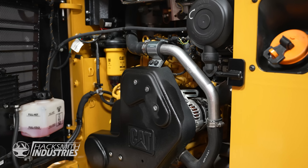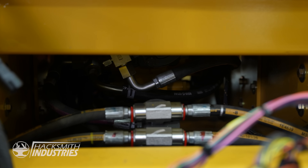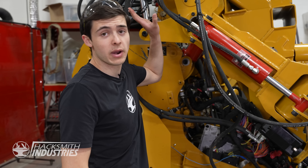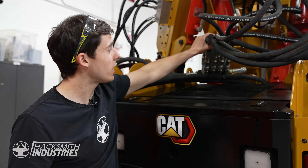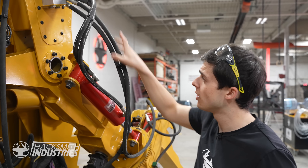Let me walk you through our current hydraulic system. Everything starts over here where we've got our diesel engine that produces the torque required to spin the pumps. Underneath the feet of the power loader we actually have two hydraulic pumps: the first one for driving the caterpillar and the second one as our auxiliary pump system for the arms. The hydraulic flow from the second pump comes up here where it's distributed by the caterpillar valve block — in our case it's used for powering the entire upper body. The valve block then delivers fluid to our distribution system for the left arm, right arm, and both back shoulders. Finally, the high-pressure hydraulic fluid ends up in one of four hydraulic distribution blocks where valves allow it to extend or retract cylinders through these hoses.